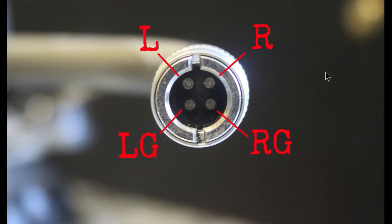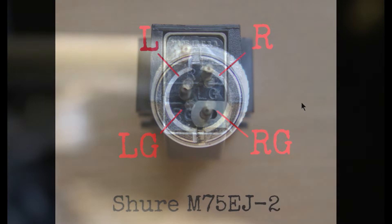Let's look at a head shell with this wiring done to it. But first, let's look at the business end of the pickup arm. I'm assuming most of us have this kind of arm where the head shell pushes in with four contacts. It helps to know which contact is which in the arm, because when you're looking at the underside of a head shell from the back, upside down, it can get confusing. Looking at the arm: top left is the left channel, top right is the right channel, bottom left is left ground, and bottom right is right ground. Sketch that out or make a mental note.